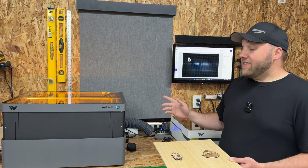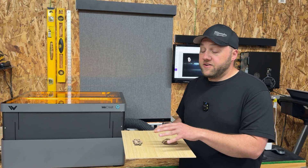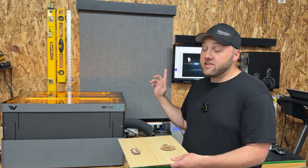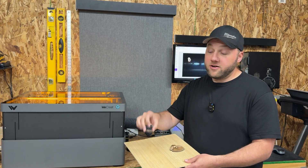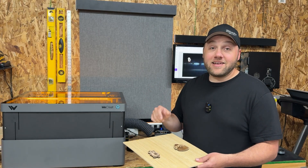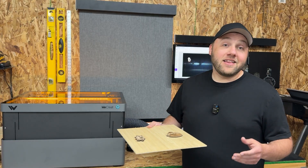It's the same thing with cutting: if this did not pop out, leave your cut line exactly where it is, do autofocus, and then recut with deeper power. It should then pop out with a clean cut and a darker engraving. That's how you can get more than one shot at a single piece of material.